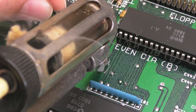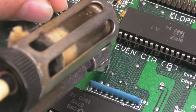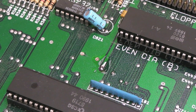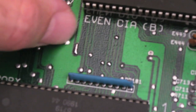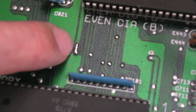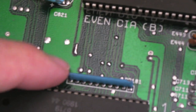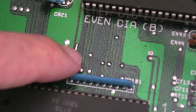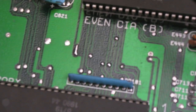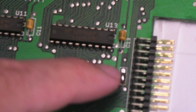The nice thing about using the de-solder station is I can suck away the old solder on the via there. The solder on the ground stitching doesn't look as good as I'd like, but we had a bad connection here - the trace was not joining the pad and the pad had a bit of corrosion all around it, which could have been an issue. I've reflowed one or two of the vias around there and cleaned up this jumper down here.